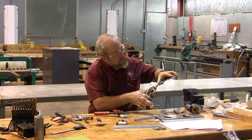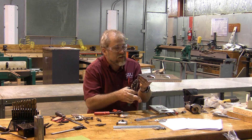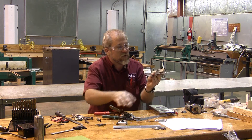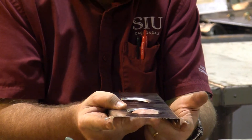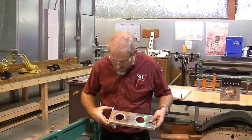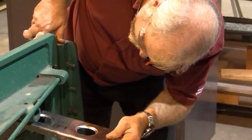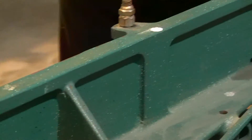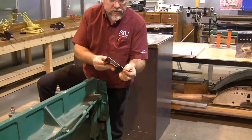There are my green snips, and they come up around the corner. My red snips pair came up around the other corner. I'm going to very carefully cut in such a way as to lift that last little tab, and I can come all the way around the corner. But now I'm going to go over and use the shear to finish this off perfectly straight. Shears can only cut things that are flat, so I've flattened the two edges. Now I can stick this in the back of the shear all the way up to the edge where I've bent those down. Make sure your fingers are well clear, and you can tear that off. It should leave you with a perfect cut across the top.